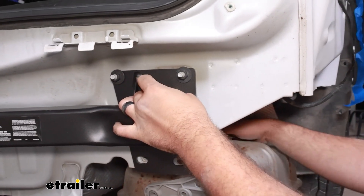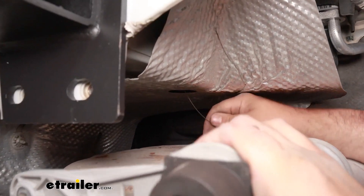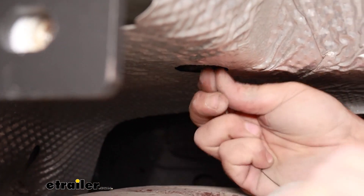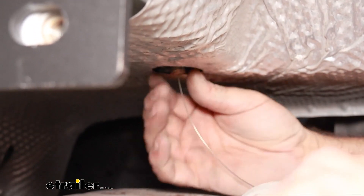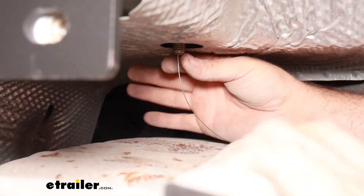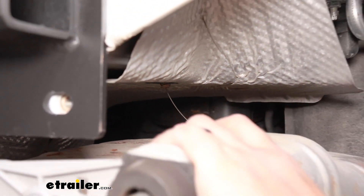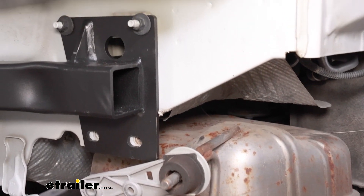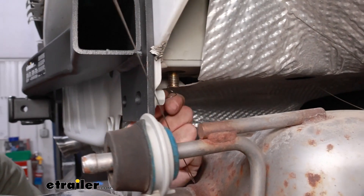Pull on the pull wire — you may need to jostle it around so the spacer block drops in and the stud drops through just like that. Leave the pull wire on so it doesn't pop back up in the frame. We're then going to do it for the front hole and repeat on the other side. Once all four are in place we can take our pull wires off.